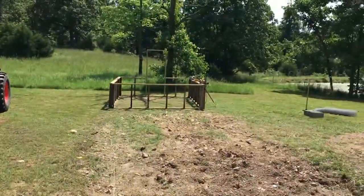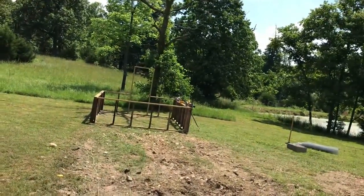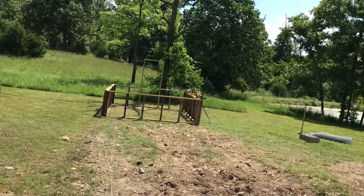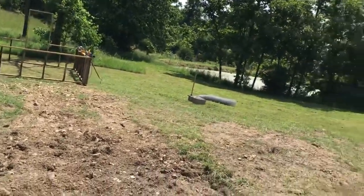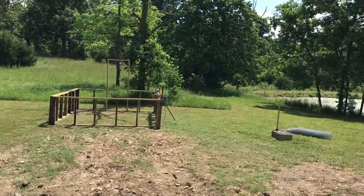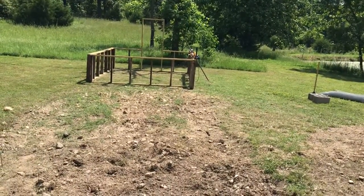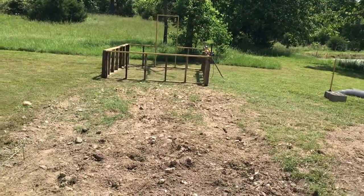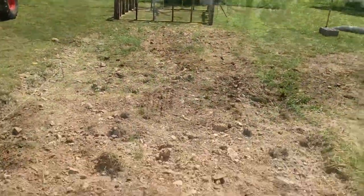I'm probably going to modify the building for the rafters. I'm looking at what I can do. I don't think I need as many rafters as it calls for. It should be 7 on each side. There's 14 pieces per side, which is 28 pieces. And I really think I could probably get away with maybe 8 per side. So anyhow, I'm gonna start getting it done. All right, and I'll update as I go through.